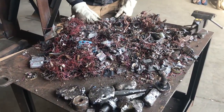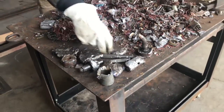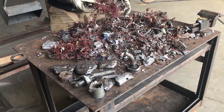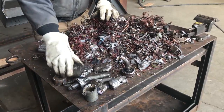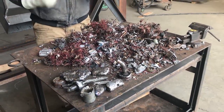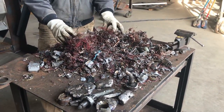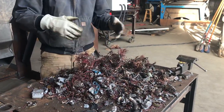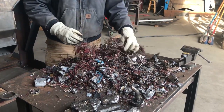So here are those two alternators and starters that we put in. Really the only reason to pre-shred those is to take out the big steel. These big pieces of steel really hinder your ability to finally shred this up and liberate the copper and the steel. By pre-shredding you can liberate all this big steel, have someone on a picking conveyor picking it out, and then have all this stuff go through one of our smaller scrap lines with a much smaller screen.